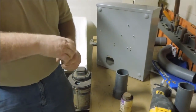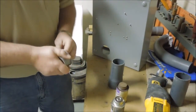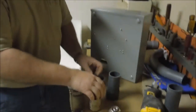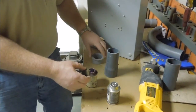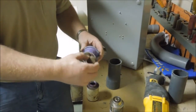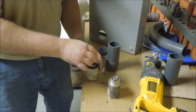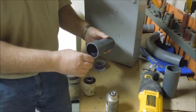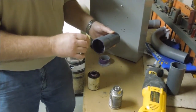When you're gluing together PVC pipe you need to use cleaner and cement. You can glue it together without the cleaner, but the cleaner makes it set up faster. And if you're doing PVC pipe for plumbing, the inspector is going to come look at it and see if there's purple on it, because that's how he knows you used purple primer. That's why it's purple. If you don't use purple primer you will not pass inspection — your permit will be revoked and you'll get to cut out all that stuff that doesn't have the purple on it and throw it away.